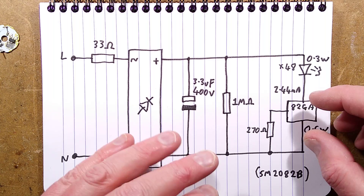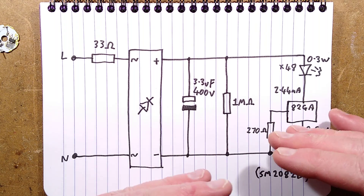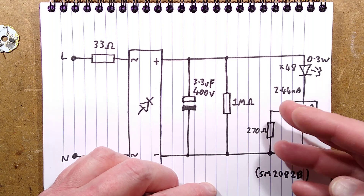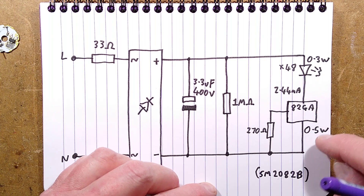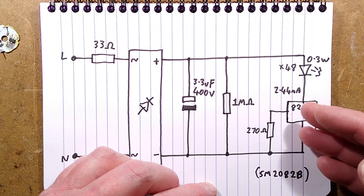If you drop a very low voltage - say you put a resistor in and the voltage across it is quite low - any mains fluctuation would result in intensity variation: the current would modulate through the LEDs, and when people turn things on the lights would dip. The linear regulated current helps prevent that.